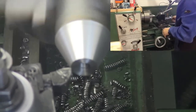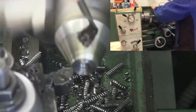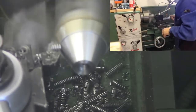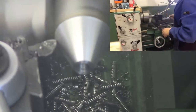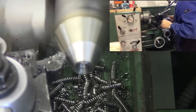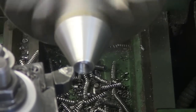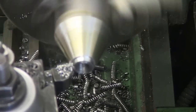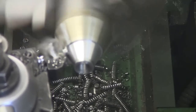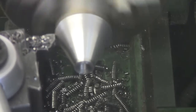When I get down here to the end, I want a little vertical collar, if you will, to come down before the taper starts. You'll see me come in with the carriage feed — the longitudinal cut for a little bit at the end here — and get that collar started. And then from here, I just continue the cut with the compound to get the continuous taper there. I did two passes.